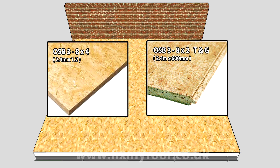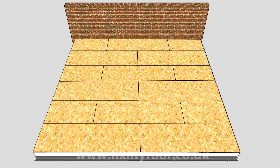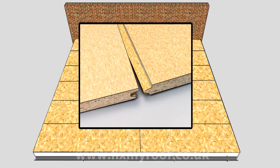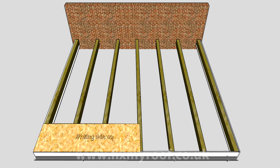Here are really your two best choices and they're both OSB 3. This is because OSB 3 is designed to resist moisture and has a nice rough surface for fiberglass to grip on to, so as long as you keep it clean and dry you will be okay. Let's look at probably your best option if you can source some, and that's the 8 by 2 tongue and groove OSB 3. The boards are laid in a brick bond fashion, typically running at a 90 degree angle to the roof joists underneath. Because the boards are tongue and groove, every edge of the board supports itself upon the other. They also have other benefits - amongst these things is that they will be easier to carry and will produce less waste than cutting, so unless it's a small job I would really try to get hold of these.